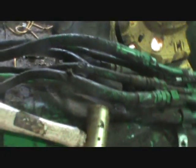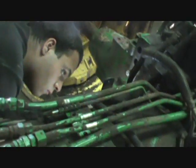So when I get this apart, I've got to clean this, obviously, but I have to take this plate off of here and remove that input shaft that goes to the back of the transmission. I know it's in there someplace, but I don't think it turns anything back there. It just turns a power shift pack in the front. Well, I could hear it in the back here too. Yeah, probably for the oil pump. It runs the oil pump. So this has got to come away.